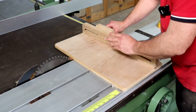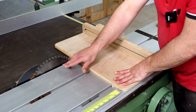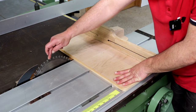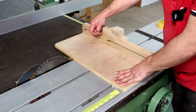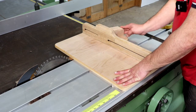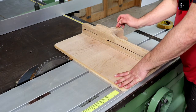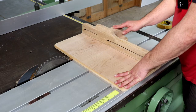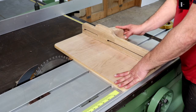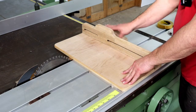Now with the first cut, what I'd normally do is leave the blade up to the maximum, you won't always be using it up there, and just run it till it's just past the highest part of the blade, which would be the centre of the blade, a little bit past that, gets to the fence here. And then you're into your block at the back as well. Once you cut it there the first time, every other time when you hit that depth, you'll feel the pressure coming on the blade, so you'll know to stop. So you won't be coming out through the back here where you have the blade protector on. So we'll run this cut, and then I'll move the camera around and we'll cut a few little bits and pieces and you can see the way it's done.